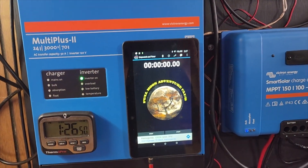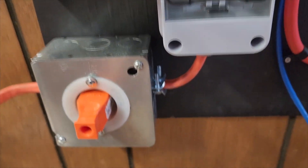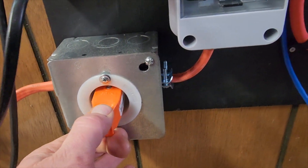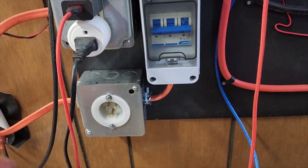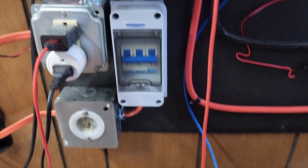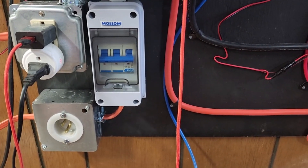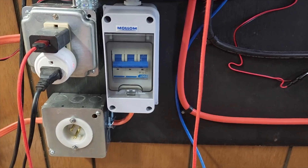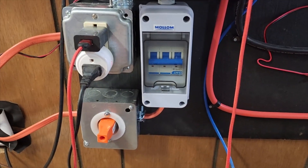This is a metal case, so I just used magnets in case you want to attach a tablet or a little clock. Down here you can see I do have the male generator plug, but it's not currently wired into the system because I am feeding power from the grid in my house. I would need a permanent disconnect switch to make sure that when I plugged in a generator, it didn't back-feed the system when the power came back on. So I would have to unwire the house line before I actually used a generator. Right now I just have an extension cord plug with no extension cord in it just to keep those covered up.